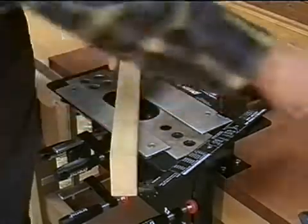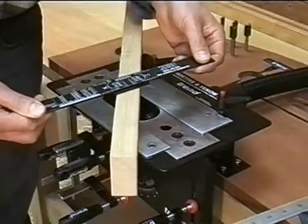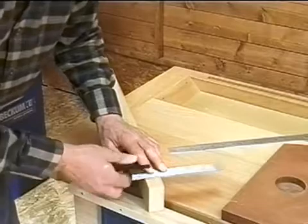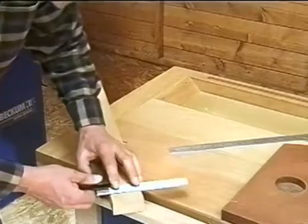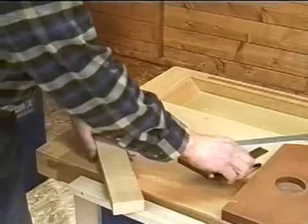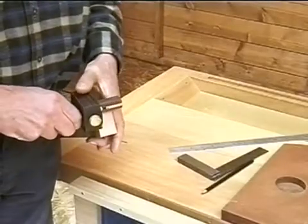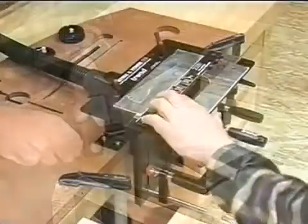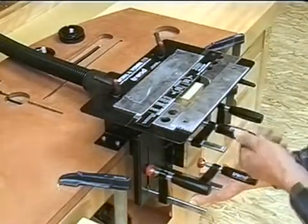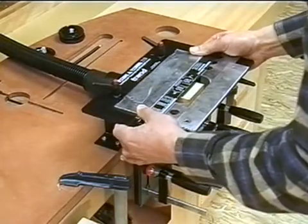Then, by referring to the setup bar, you can determine the correct combination of the mortise cutter and tenon guide bush required. Mark the shoulders on the tenon as normal. Unlike the normal method of marking the tenon with both cheeks marked for removal, with this jig we only need to mark the center line on the end grain. When all parts are marked out, insert a rail vertically, ready to form a tenon. Use the setup bar to set the correct height and centering of the tenon timber.